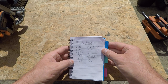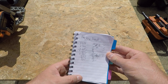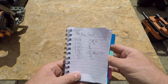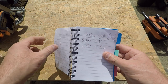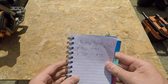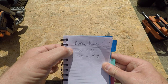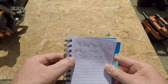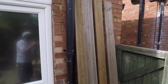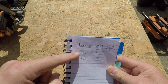As mentioned, I was measuring up the offcuts for the decking boards. We have a number of different sizes, and what I wanted to know is if we try and standardise those, what do we end up with. If we cut these to ensure we have a couple of standard sizes without too much waste, we can cut 11 at 600mm and 12 at 360mm. I do have some longer lengths of decking board, so I could cut another 600mm from there.